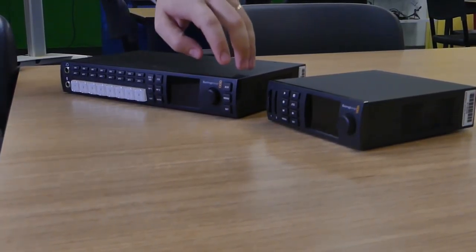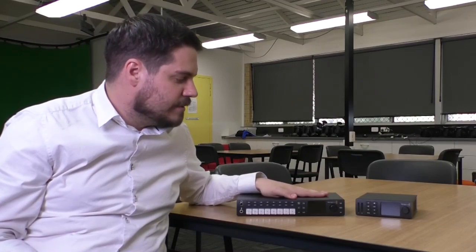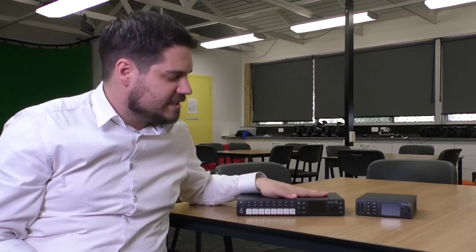With most live TV studio recordings there's a lot of sensitivity when the TV Studio is trying to pick up cameras. You need to go through Menu, then Set, and use the dial to navigate the menu — one of the things it will ask is the format you want to record in, such as resolution and frame rate, which needs to match your cameras. The maximum this unit outputs is 1080p 50, it also does 1080i 50 for older cameras, and 720p. If you're interested in 4K, there is a 4K version of this box but it is SDI only.